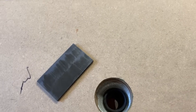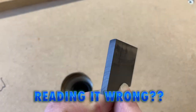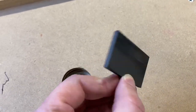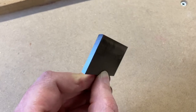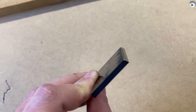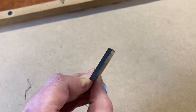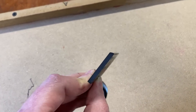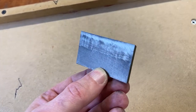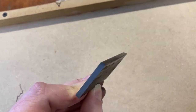Looking at the spec sheet, these are 35 millimeters, which it says is actually the maximum height — so they're barely worn at all. That seems amazing to me because we're well over halfway to the 3,000-hour inspection interval. Kudos to Becker for that. Whether people buy the Becker vanes or cheap knockoffs, the original Becker ones seem to be performing really well.